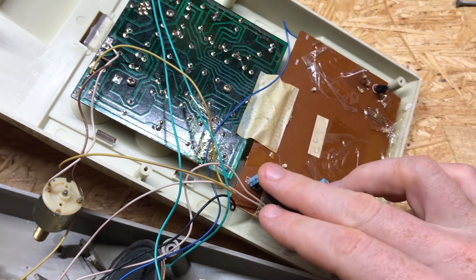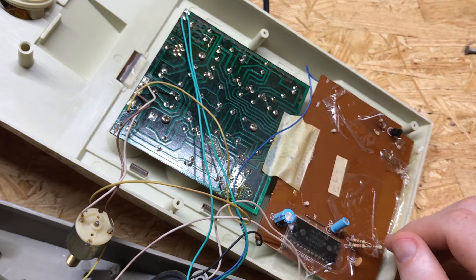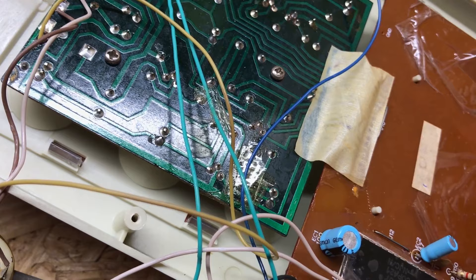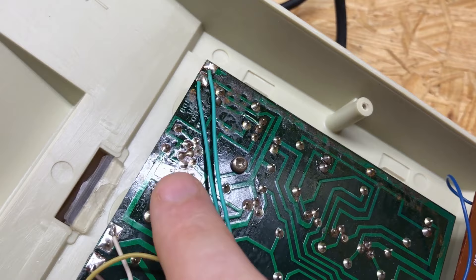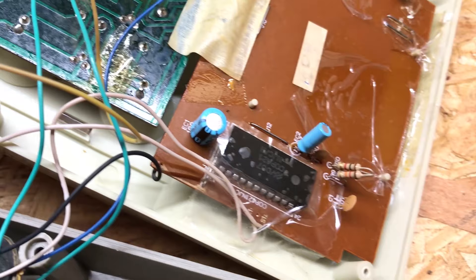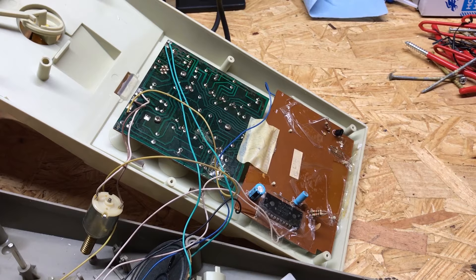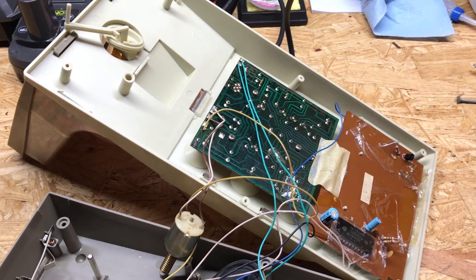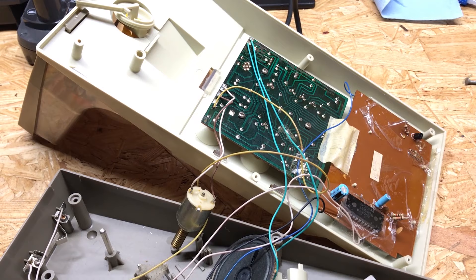I've looked over this a bit. I don't really know how to test capacitors to see whether they're any good, but my thoughts are: the way it's malfunctioning, possibly some solder joints are bad. Looking at that board, there's a spot there that could possibly be touched up, reheated, reflowed. But it's also possible that given the sheer age, these old capacitors are just failing. So I'm going to work on both aspects — the first and fastest thing is to reflow a lot of this soldering. If it starts working, great. If not, I'll get into the capacitors, which I'll have to order and complete at a later time.